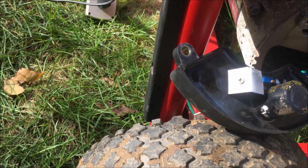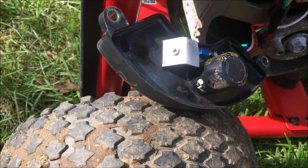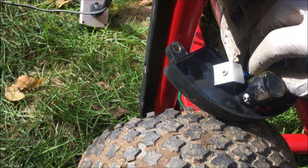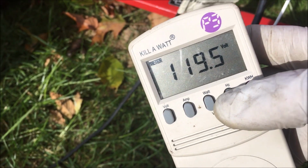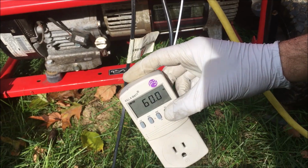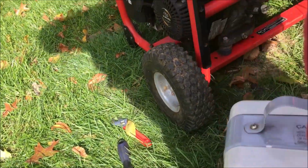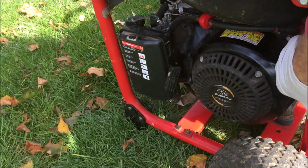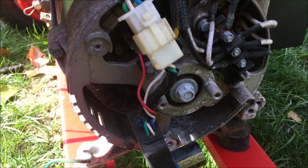Okay, and the voltage is pretty good. It's like 116. And if I wanted to bring it up a little bit to 120, I could turn that potentiometer to the right. Might see if I can do that and get it a little bit closer to 120. Alright, just going to button this back up. Thanks for watching.